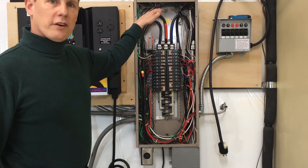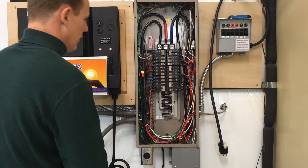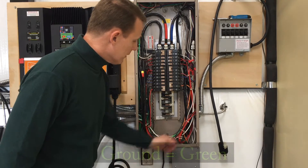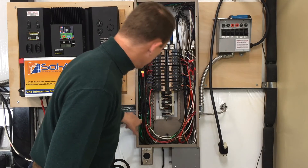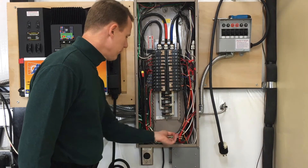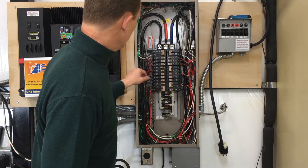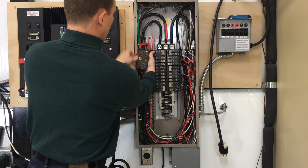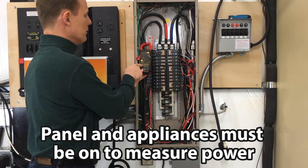Before we started, we went ahead and turned off the power to the panel. Ours is outside. We ran our wires from the transfer switch through a punch-out in the box. There's a neutral wire that wires up to the neutral bus and a ground wire that wires up to the ground bus. In addition, there are six different circuits, A through F, with a black wire and a red wire corresponding to each and they're all labeled. It's good practice to use an amp meter and measure the amount of current expected on each circuit — we can determine the wattage by current times 120 volts.